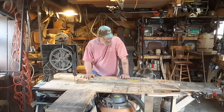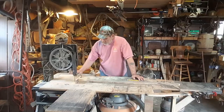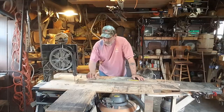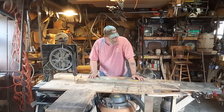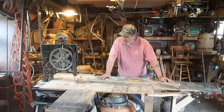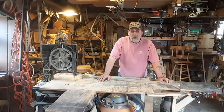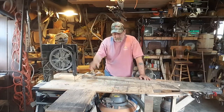We cut it. I made up a jig here. You got to take your bandsaw table and I just take a piece of three-quarter inch plywood, throw some holes in there and bolt her down. Get her in the center where your blade is, and come back here for this particular stage to get that arc. You got to come back from the blade — from the front of the blade back to the hole — and your pivot point is 45 inches to the center.